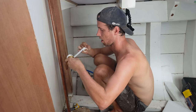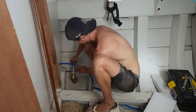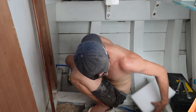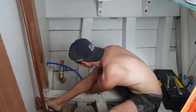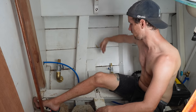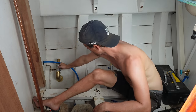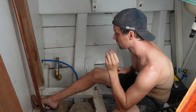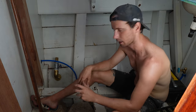It's a bit hot. There we go — we now have two through holes drilled for the heads. We can move this around whenever we want but it's not in the way. Now this one is going to come up through the waterline, above the waterline through a siphon, into the toilet, and then it's going to go out up here through a siphon above the waterline and out this way. I don't think I can do the other toilet yet because I just placed the Sikaflex and I don't want to be forcing the through hole itself before the Sikaflex has dried. So that will be for another day.